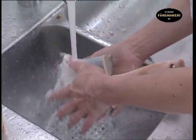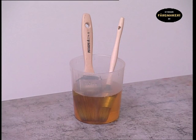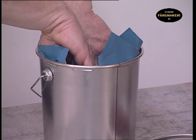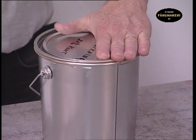If you intend to continue painting in a few days using the same paint, it is not necessary to wash the brushes — just let them remain in raw linseed oil so the paint doesn't dry. The leftover paint is best kept by placing a piece of plastic directly over it before putting on the lid. This will keep the paint fresh and without a skin forming for the next time you are ready to paint.